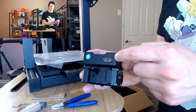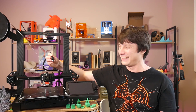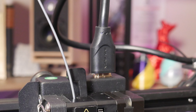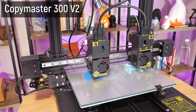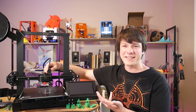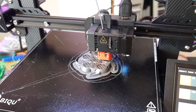Something I'm a little ambivalent about is the HDMI connection. Your hotend now uses an HDMI cable and connector to transmit power — it's not used for any images or audio, just power. It's a really strange choice. I've seen some companies use RS-232 style cables that lock in place, which made a bit more sense, but this one is just a friction fit. It works, but it is a really strange choice especially considering everything else in this printer seems to be quite custom.